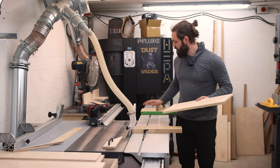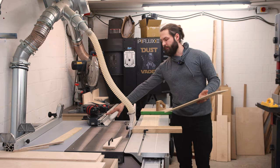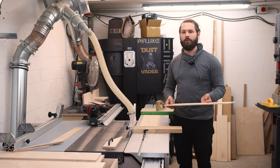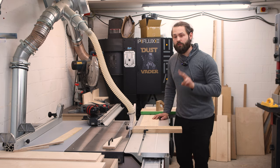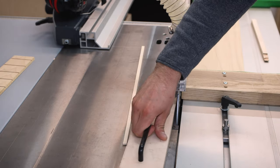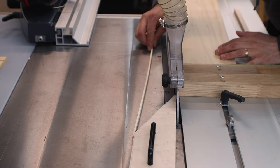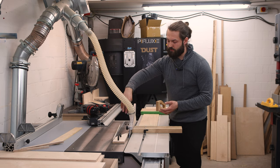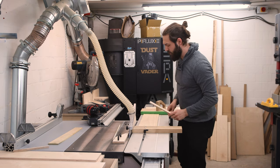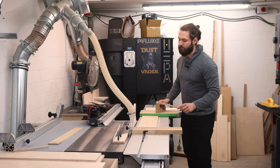Here at the table saw I use Fritz and Franz, which are these little jigs. I use them to hold my workpiece and use my parallel fence to get the rough thickness. I'm going to aim for about 4mm, so I have about 0.5mm to remove at the drum sander. Two things that really speed up the process: a deflector wedge — it has two magnets and goes in the back of the blade, deflecting the strips away from the blade so I can cut faster without reaching over. The second thing is just an offcut to push my workpiece against the fence so my fingers are safe and I can just rip and rip pretty fast.